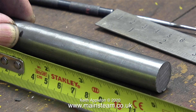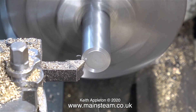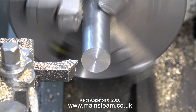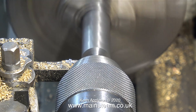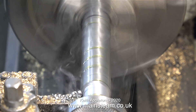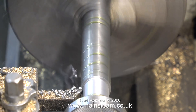Thinking about it, that would make a really good girlfriend joke - but on the grounds of good taste, I'll get straight on with the machining. There were two pieces of bar: one was 1-inch in diameter, and this one that I'm using is 3/4 of an inch in diameter. The difference being that on my small Boxford lathe, the 1-inch diameter piece of steel bar will not go through the spindle, but the 3/4-inch piece does. I think it will be strong enough at 3/4 of an inch - the axles are 16 millimetre or 5/8 of an inch - and two pneumatic tyres on an axle of these dimensions will be fine to carry my weight.